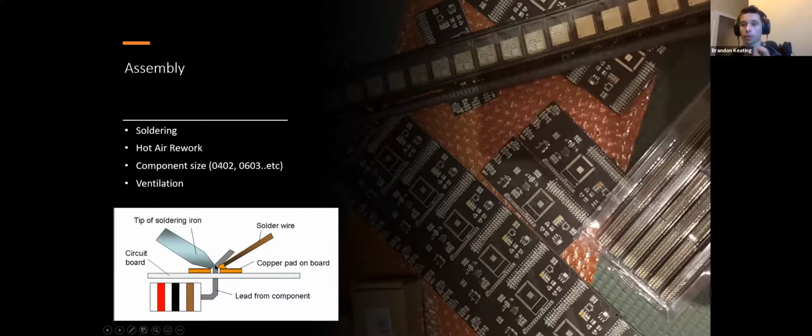Throughout making these, sometimes I would solder and complete a board, plug it in, and it would not get recognized by my PC. Device Manager had nothing to say about it, or it would just give me warnings and whatnot. So this would involve me going back in with a multimeter or something else, and testing these connections. Generally, if my computer can't see it, I can assume it's the USB connections, because those are the smallest, finest connections on there, most likely to have had soldering mistakes when I put it on. So there was a lot of that. I had a whole pile of them going for a little while, of just PCBs that were not being read by the computer. So that's one way of diagnosing it, but the testing's the next slide, so I'll get into that.